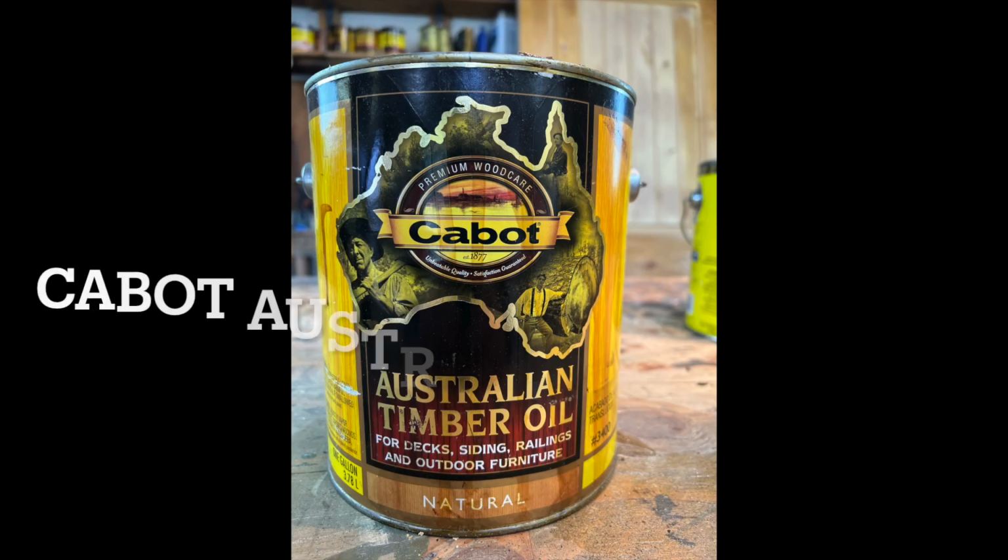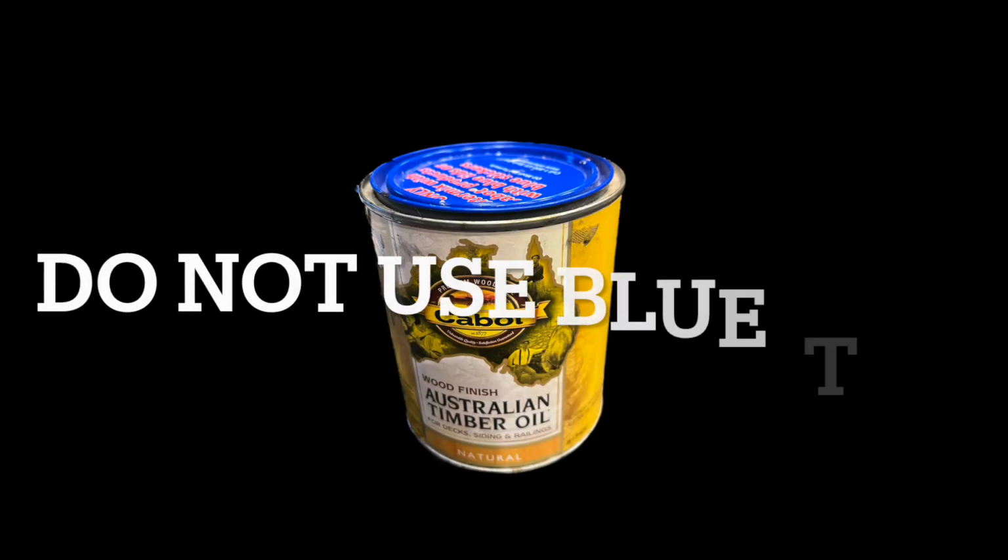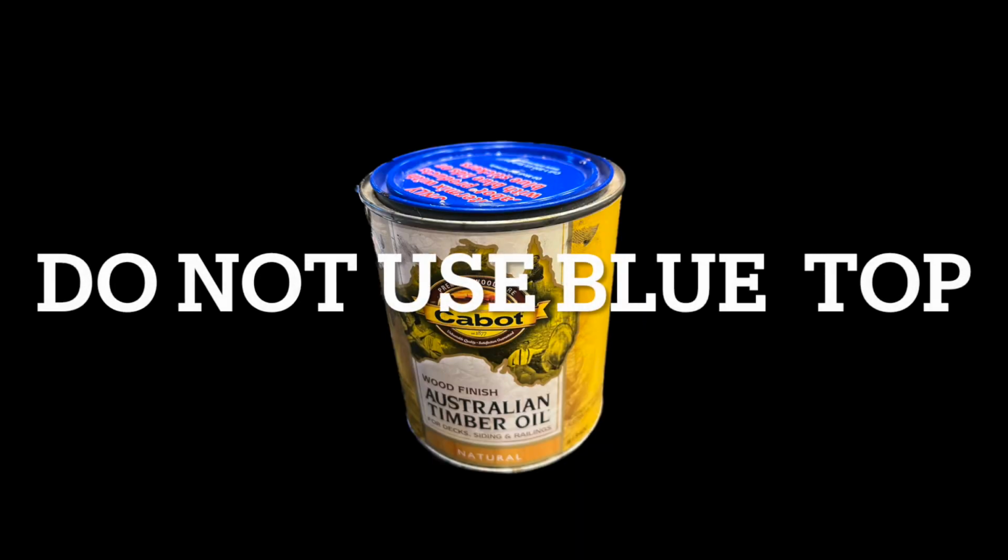The next one we're going to look at is Cabot. Cabot has Australian Timber Oil, which is a really good oil, and you can get this at Menards, Lowe's, and Ace or True Value Hardware. Now, the thing about Cabot is they've been reformulating some of their products, so do not use the ones with a blue label. These are water-based. These are not oil.